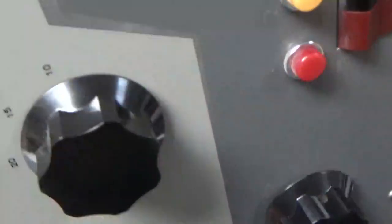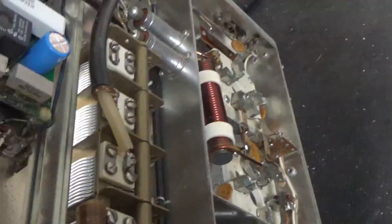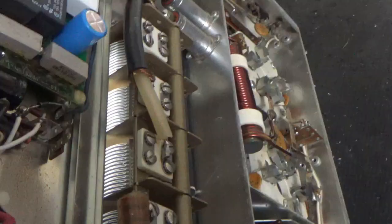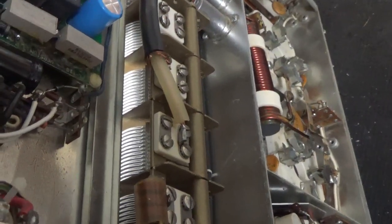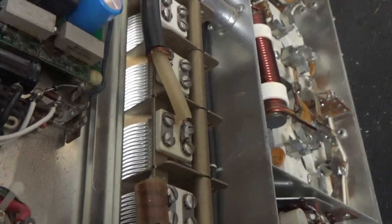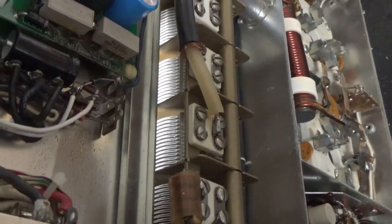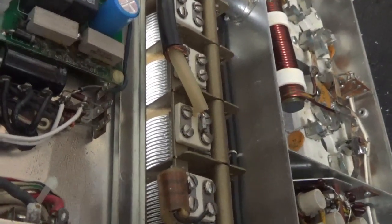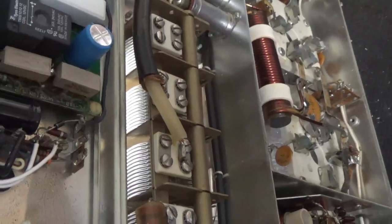I will go through the top: oil the fan, put in meter protection diodes, and do everything else I normally do up here — check it all over. On the power supply side of the bench I'll replace the high voltage fuse, take those 50k resistors out that they use to put the tubes in cutoff, and put 100k resistors in. Tubes will still be put in full cutoff and will run a lot cooler. Also change the 5k resistor below it.